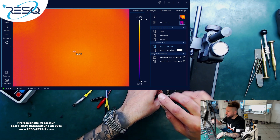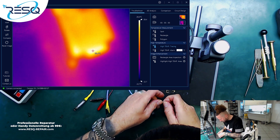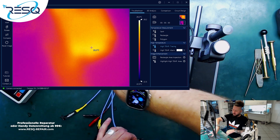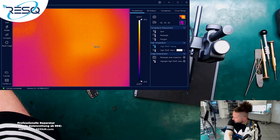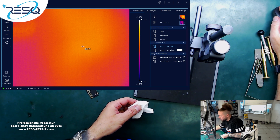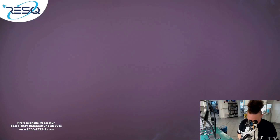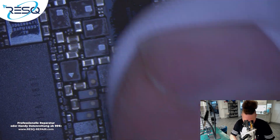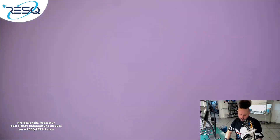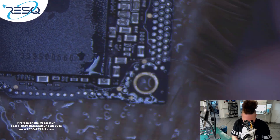Yes, it was that one — I was right. So normally we can boot up the device again. We have no short circuit anymore at all. Connect both layers back together. At the microscope: here we had one capacitor — I just removed it — and we are back to life. The device will work fine again. So it's a repair, not only a data recovery job, because we only had a little short circuit on the board on power positive VDD main.